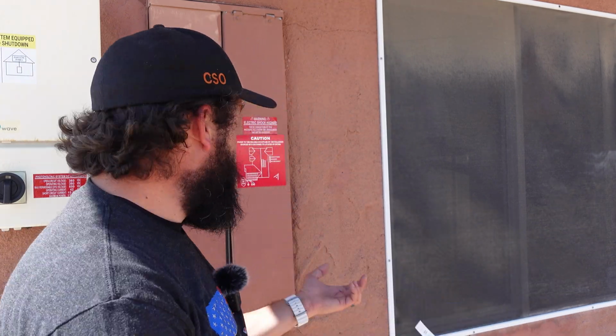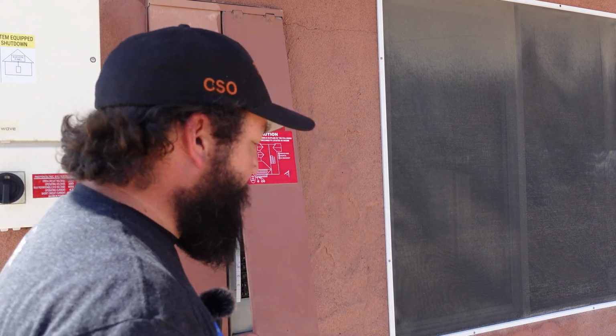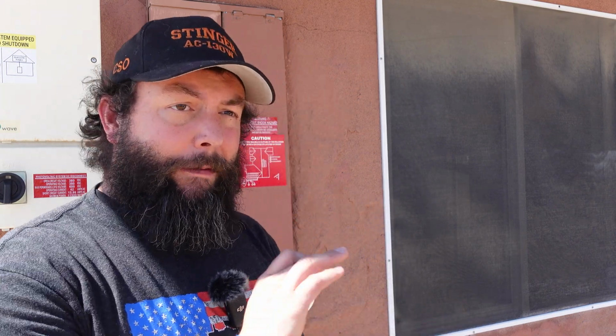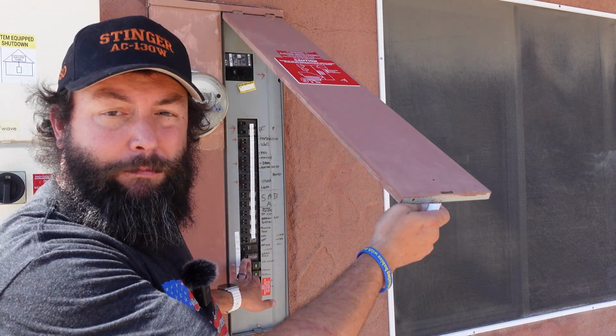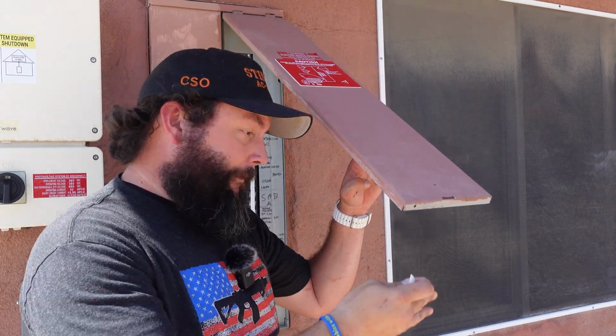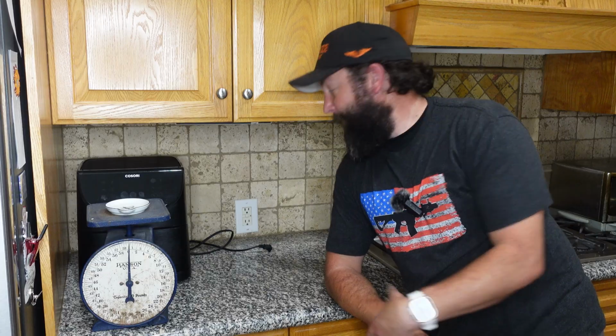And then what I'll do is, for example, say Ella's bedroom, that breaker, is actually labeled number 25. So on the map that I'm gonna basically laminate and put underneath here for storage, I'm gonna put 25 next to all the outlet symbols in her room. That way we can tell both ways, either by looking at the label on the breaker itself that 25 is her room, or we can look at the map and say, oh, it's 25, and then go directly to 25.